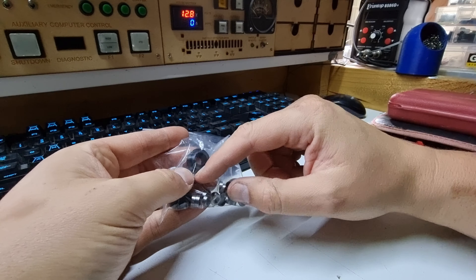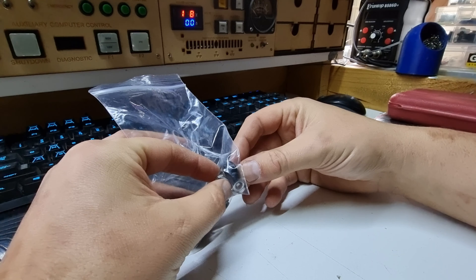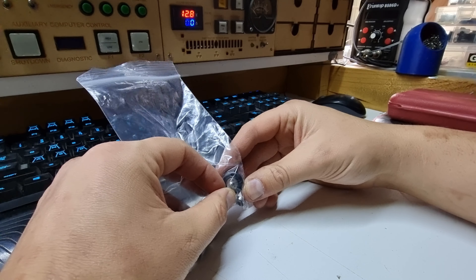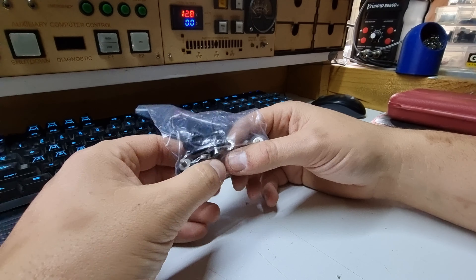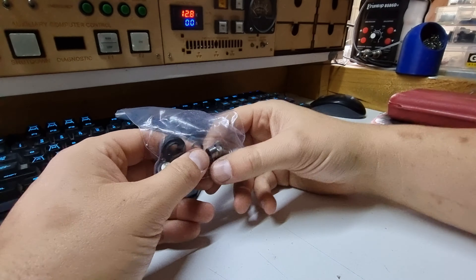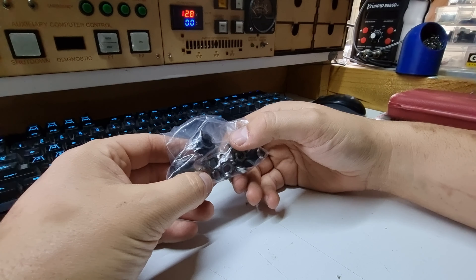The bearings that came with these were 9mm bearings and the ones we have are 10mm bearings, so I'm going to run a little bit of machining. This stud is also a different size, so we might re-engineer the studs and use a nylock nut on the top with a washer to hold the bearings in. That or I can get the correct bearings, but they're insanely more expensive. So we're going to try and make these work as a spare set. Although given those original bearings lasted 9 years before they failed, it could be a while before they're needed.